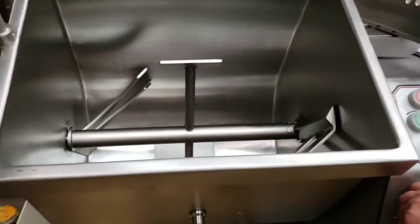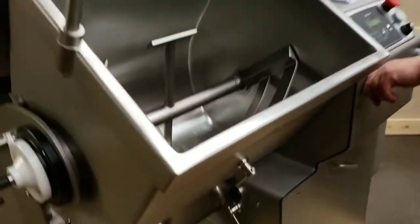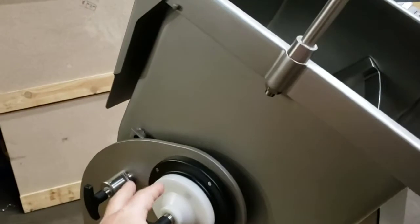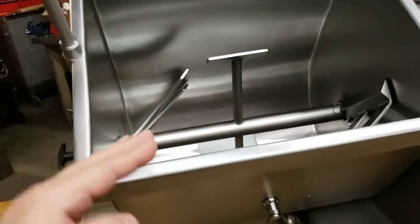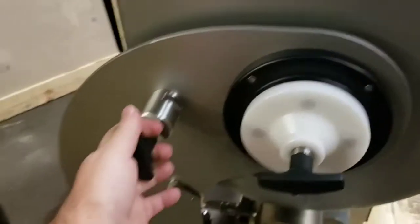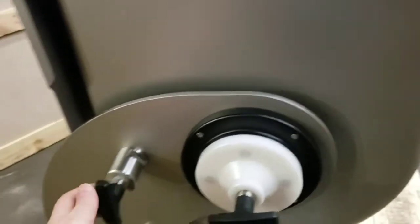The machine is good for meat, and it is also good for dough. If you put the bucket, the hopper, in an angle like this, you have the control here of the locking mechanisms, you will know that by pressing it will not work. It either has to be all completely down for offloading or completely up. This is how you unlock and lock the bucket.